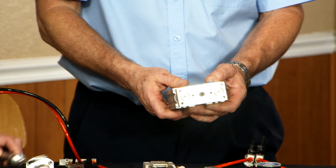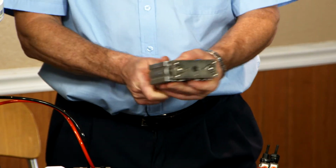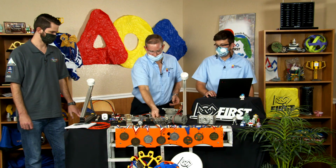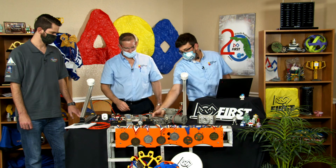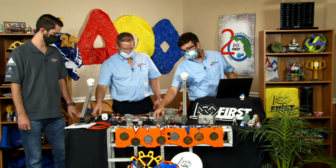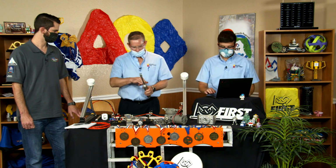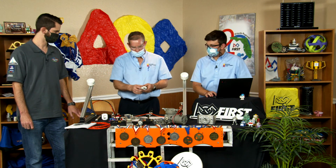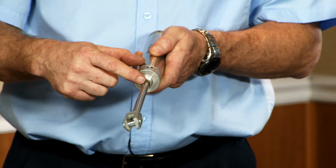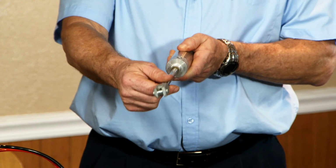So you're less likely to get that. You would be a lot less likely to get that. You have proper bearings rather than the seals, because if you're side loading one of these things, you're basically putting all that load on the seals, and you're going to get leaks and chattering and all sorts of problems that way. As Jordan said, with the side load, because this piston is so short, when the cylinder gets all the way extended, this bearing is minimal. So what happens is the rod can move up and down.